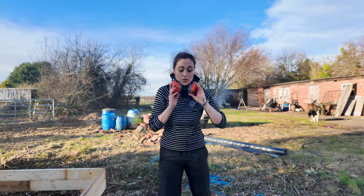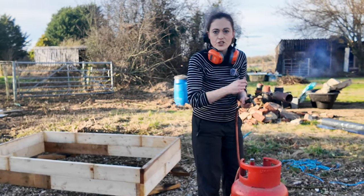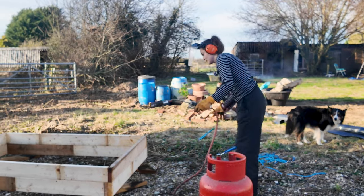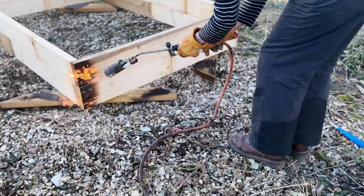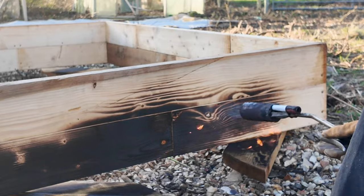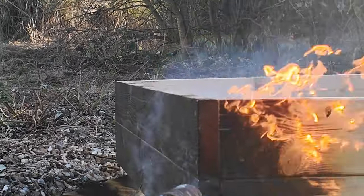This is the propane gas bottle I'm using and this is a roofing burner my dad's lent me. To light it, I need to turn it on very slightly so I don't burn myself, and then once lit I can turn it up. I'm putting some PPE on — I just need to hear the gas. After a first practice run off camera, I found it was best to go slowly in the same area to allow that section to heat up and char. Don't get the flame right close up to the wood because it won't burn efficiently. The knots also needed more time to heat than other areas. During a trial run without dipping the ends in linseed oil first, the end grains actually took so much longer to burn — so dipping them was more beneficial.